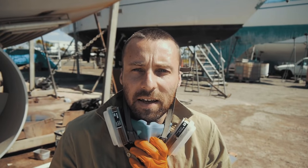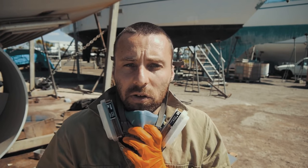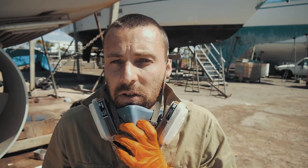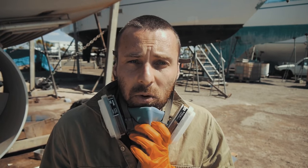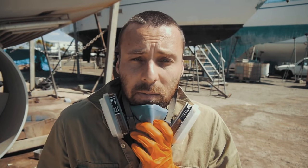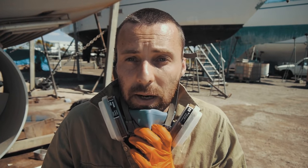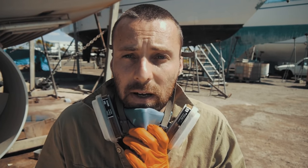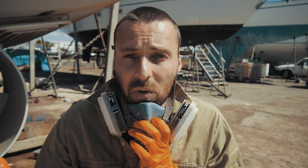As quick as that — it's pretty fast to paint this stuff on. It's quite a thin paint, which is actually really good for us because you get a lot of area covered per litre. Those two big panels probably used maybe a quarter of a litre, so it's really economical. A lot of the epoxies we use are really thick — to paint the deck, for example, we used close to 15 litres just for the deck alone. So yeah, thin paints are actually quite easy to apply and they go a long way.